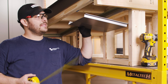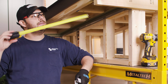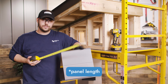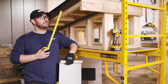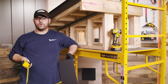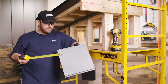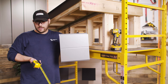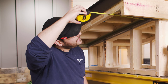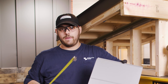It's very easy — the panels are just going to slide into place and we're going to put one screw in. You want to measure the length between your J-channel — the inside of your J — to the end of the sub fascia, and use that measurement to get the panel width. Also subtract about a quarter inch for expansion and contraction. Another thing to think about is sub fascias are rarely straight, so if you have a long panel run, take measurements down the length of your roof and cut your panels to each measurement — don't take one measurement and cut them all. One benefit of the flush wall panel if you have a roll former on site is you can cut them as you go. My measurement is 12 inches on the dot, so I subtract a quarter inch — 11 and three quarters — that's what our panels are.